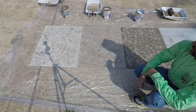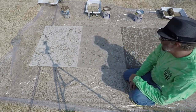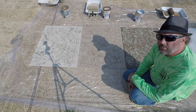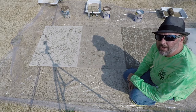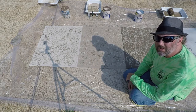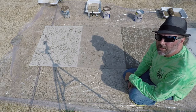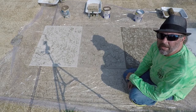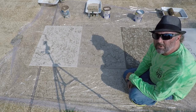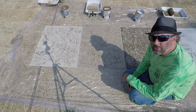So this is just a quick, simple, and straightforward technique that I do all the time. It's very effective, very easy to do, and it's an easy way to make money on pool decks and patios without using overlay. It doesn't matter how old the concrete is or its condition — it's a solid colored sealer, it's going to hide the ugliness of the concrete. The sponge is going to hide some of the cracks and imperfections, and you're barely going to see them because of all the sponging. Add design to that and you've got one heck of a beautiful pool deck.